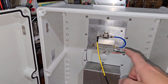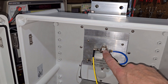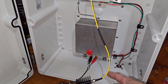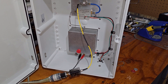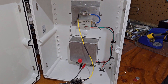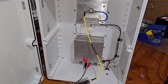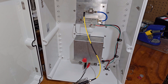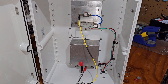The actual output of this 2-watt amplifier is probably close to 2 watts, because there's 0.4 dB loss in the isolator, and this cable — I haven't measured the loss — is probably around 0.75 to 1 dB loss. If we say 1 dB loss plus the 0.4 dB in the isolator, that's 1.4 dB added to the 31.6, giving 33 dBm — which is exactly 2 watts. So I suspect the amplifier is actually putting out very close to 2 watts.